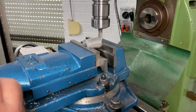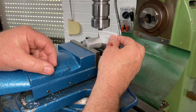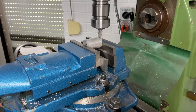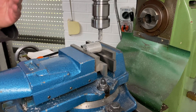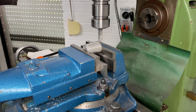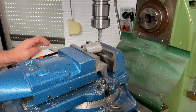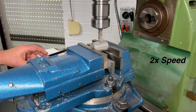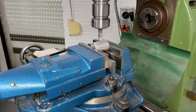I've got my Y set ready to go and I'll show you by a piece of cigarette paper — if I just gently bring it towards the cutter you can see it rip it out of my fingers, so I know I'm good to go. I'll back him off down here. One turn of my handle is 4mm, and I have to add 6mm because it's half the cutter, so I need a total of 27mm, which is 6 and three-quarter turns.